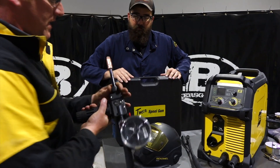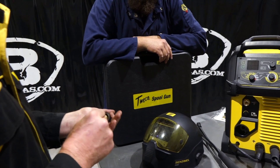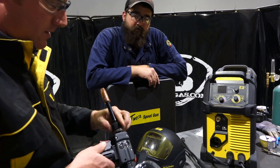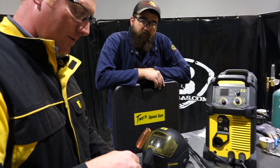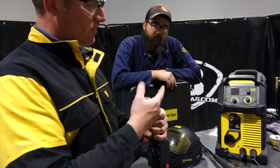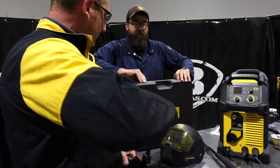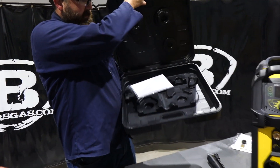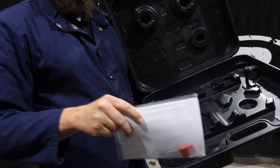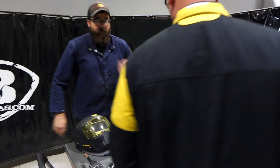When the spool gun comes first thing out of the package, the gooseneck will not be installed on the gun itself — inside the box it'll look like this. Ultimately what you're gonna do is pull the gooseneck out of the package, hook it up here, and then just thread the fitting on. Make sure you run the correct diameter tip — it is a thread-on style nozzle, it is a threaded tip. We're gonna run 035 diameter wire today. The kit comes in this nice carrying case, and inside it's got all the placement holders: loop straps for the whip itself, the gun fits, it's got tip holder, nozzle and diffuser holder, and a manual. Pretty nice little setup.